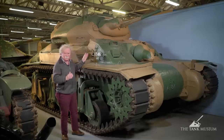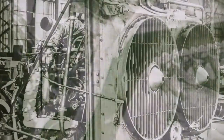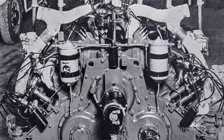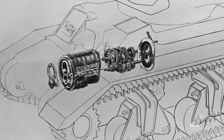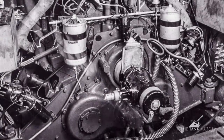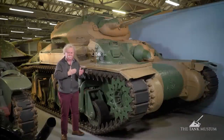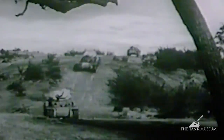That's the basic structure of the tank. Now the engine — they had a real problem with it; they had no big enough engine to drive the tank along. So what Monsieur Perrier suggested was a triple layout of Cadillac V8s: three engines of about 100 horsepower each, all arranged to drive into a single five-speed gearbox near the front. It's described as a cloverleaf formation, because you've got two engines on the flanks a bit further forward and the central one mounted a little further back. So you had an engine effectively of about 330 horsepower.